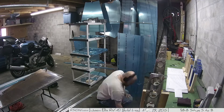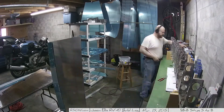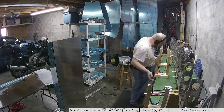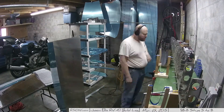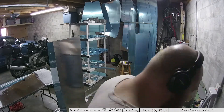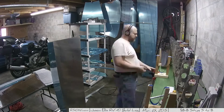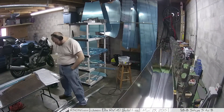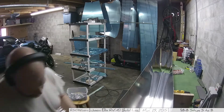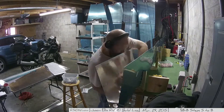I did try cutting down it and was able to pull off smaller pieces, which was a lot better. You can see it took a lot less time, but still getting those things off is just dreadful. Now you're going to see the cradles come into use — yay! This was really the first time I had tried to use them and it actually worked out really well. I realized at that point how everything was connected, and that I had put all those small Clecoes on the outside holding in the sides of the in-spar ribs, thinking I was being clever. That's not going to work if I have to slide it down into the skins — duh! So I had to undo that, but then it was just a matter of taking each nose piece off that assembly and Clecoing them on.